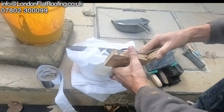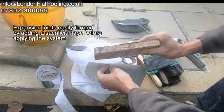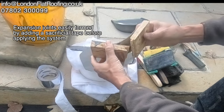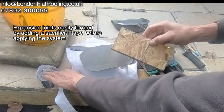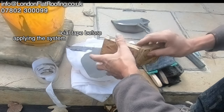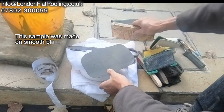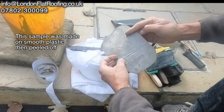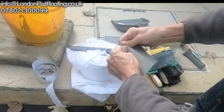These are two samples that I normally take with me and show to customers. This first one is a piece of the roofing system over the top of some OSB timber. We make an expansion joint by putting a piece of tape over the top of most joints — that way the material doesn't stick and therefore there is more of it for expansion and contraction. As you can see with this particular sample, it's extremely flexible once it's gone off, and very tough indeed.